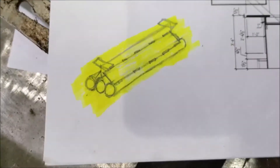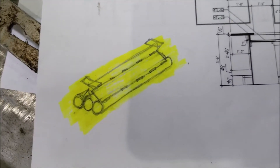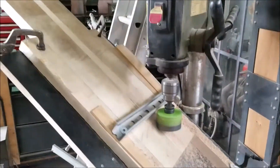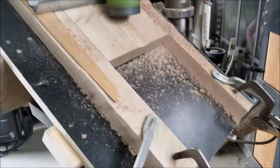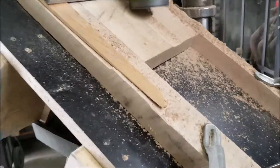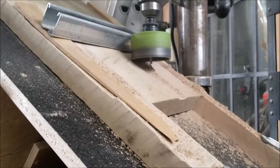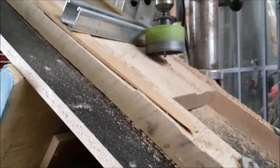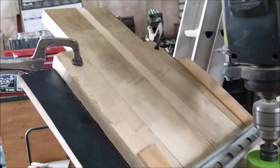This is my rough sketch concept of the upper die — how we're going to form that in our press. I decided to use a 2 by 10 inch solid maple block and try a 3-inch hole saw, pushing the material on a 45-degree angle through to try and create the lower half curve of the scallop.